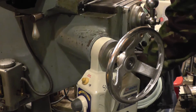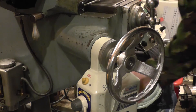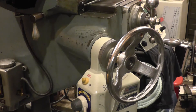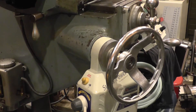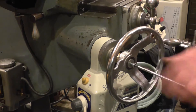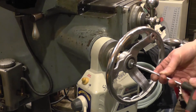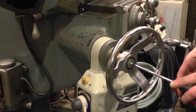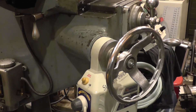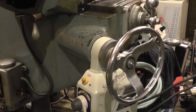One of the jobs I've got to do: you hear that knock — that's the knee locking handle fouling the back of the feed. So I'll have to pull this off one more time and reshape that locking handle. I want to make a thick retaining washer for here, but just as a temporary measure we'll use a moderately thick body repair type washer. There we go — that's all in place, feels good.